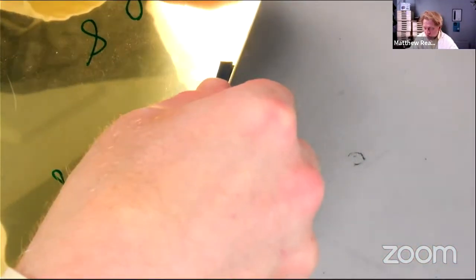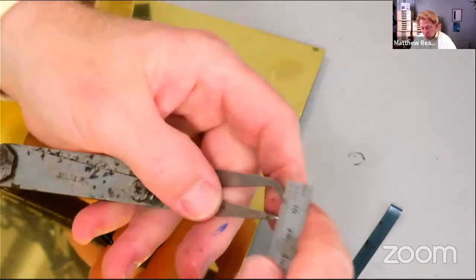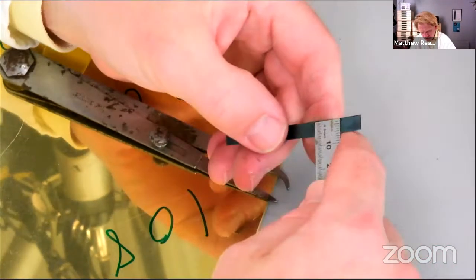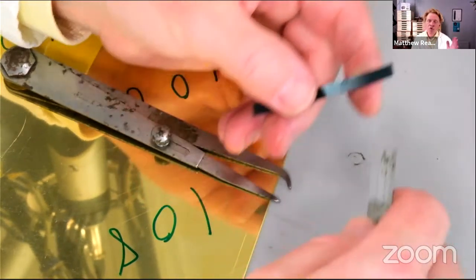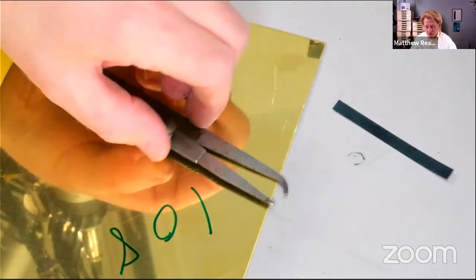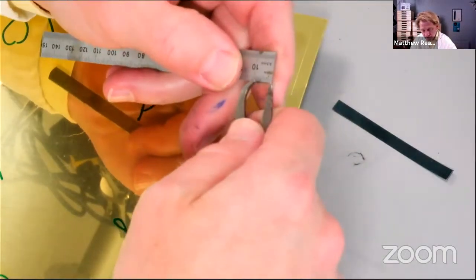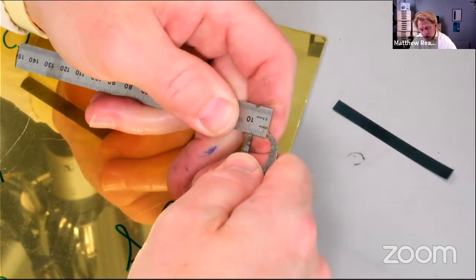It's a bit narrow. Sorry. Concentrate. So you measure up with your... I think this is a quarter of an inch, isn't it? Yes, a quarter of an inch. But we're going to fold it and we want to get rid of that guillotined edge and square the whole thing up. So I'm going to make it a bit wider. Let's make it maybe 10 mil, which is a bit over the top. See if I can get away with making it about 8 millimetres.